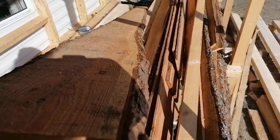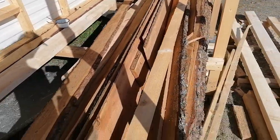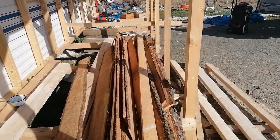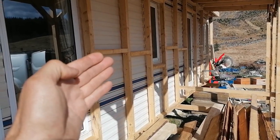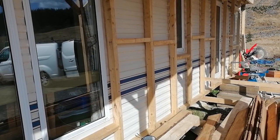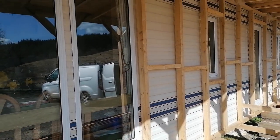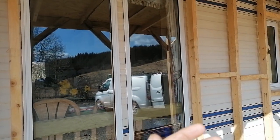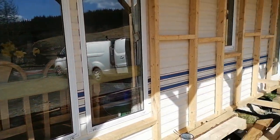This is some of the cladding we're going to be using — it's larch boards, averaging about 19mm thick, and it's still got the bark on so it's going to look really nice. That's all come from Jock's place over at Otter Ferry as well. It's going to be put on horizontally along the walls. The walls will be filled with sheep's wool, then have a layer of breathable membrane — like a very strong thin felt — to hold all the insulation in, and then we'll cover it with cladding. Once the framing is around the windows so the cladding has something to go up against, it should look really smart.